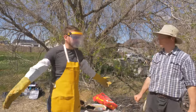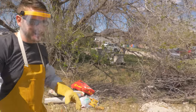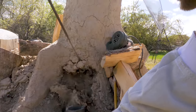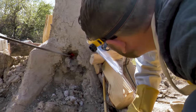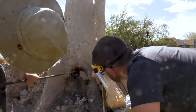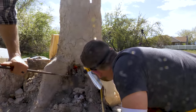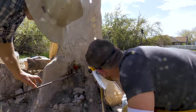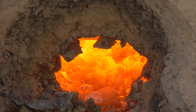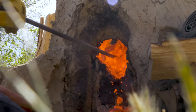Now completely suited up — the cheapest stuff at Harbor Freight. Moment of truth. Come on, molten iron, where are you? I think we may have actually made a really successful Aristotle hearth. That's solid — that's a bloom. I've never been this disappointed to see a bloom before. It's all slag. We got hot enough to melt dirt and not hot enough to melt iron. We've got primitive mold, primitive furnace. We've got advanced mold, advanced furnace. The winning combination is probably going to be the advanced furnace.